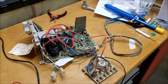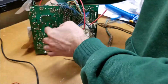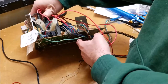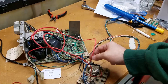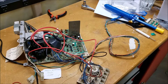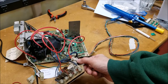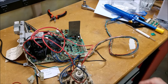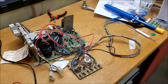That's the K7000 flyback installed. Just to recap: we desoldered the flyback on the back side, did all the points, and released the two clips so it would come free. Then we removed the two wires connected to the neck board and reinstalled everything. We got lucky — we didn't have to remove the heat sink to install it, everything dropped in quite nicely. We reattached everything, including the little door on the side of the socket, and we checked it — we are good to go.